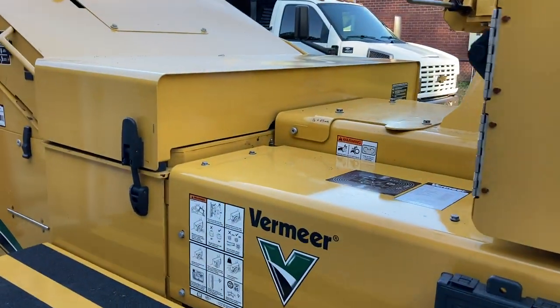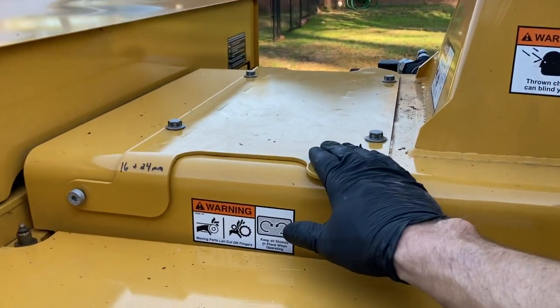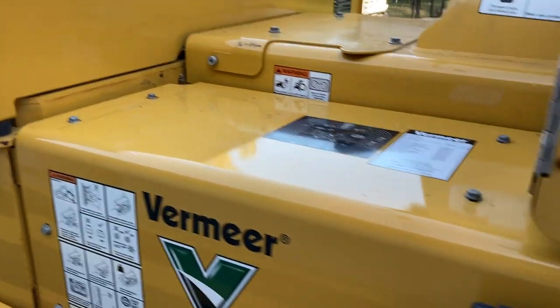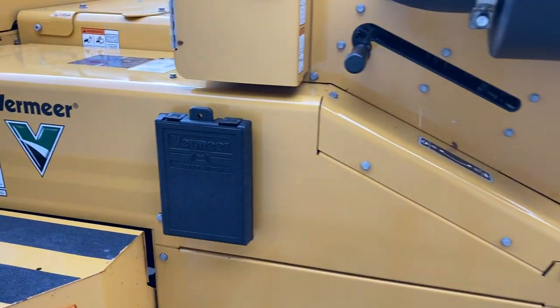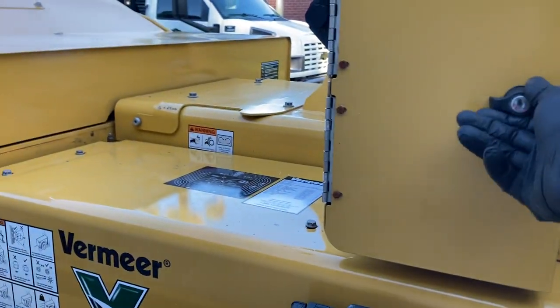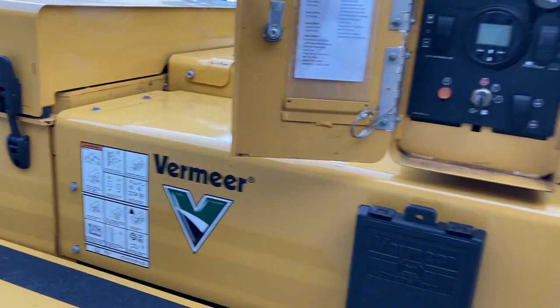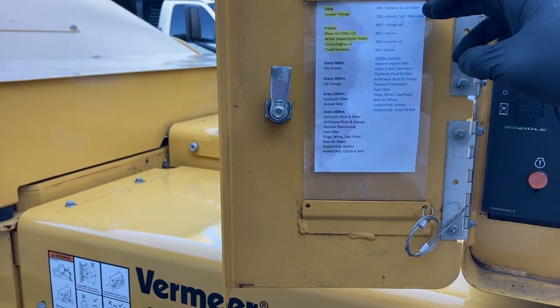So once we've got our lid closed, our springs are back on, we've relatched, we've confirmed we got all the bolts in here, our red pin's pulled out, and that we're clear of all tools, I like to fire the machine up just to make sure that everything functions properly. Nothing worse than getting into the field, finding out that you missed a step or you've got a tool in the machine.